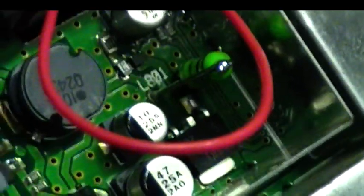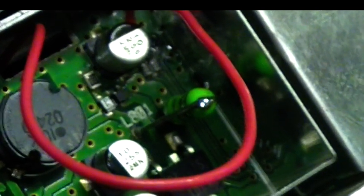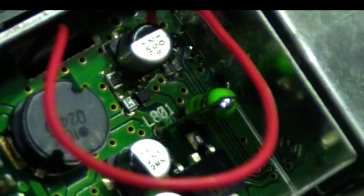If you had a go at the first stage, I asked you to cut something — there's a choke here in this top can. In the back of the PCB, I said to cut that choke, solder it up — just put a little touch of solder and join that up again. You need to do that as stage one. If you've never done that and you haven't done the first mod, then you won't need to touch that — just leave it as it is.